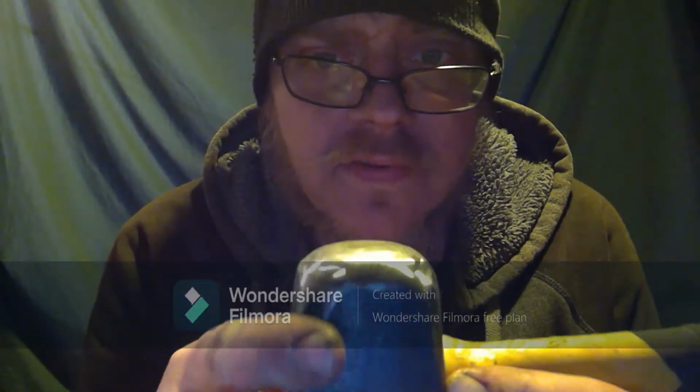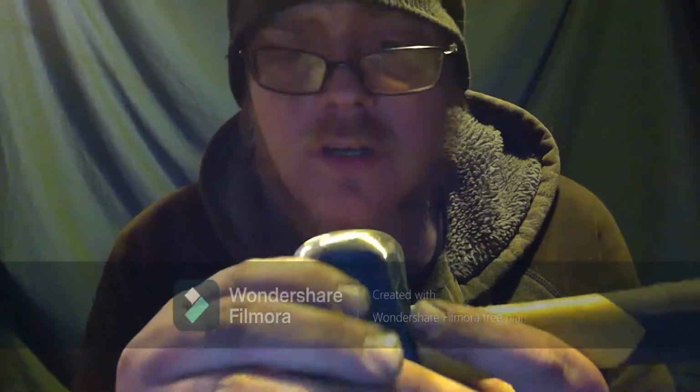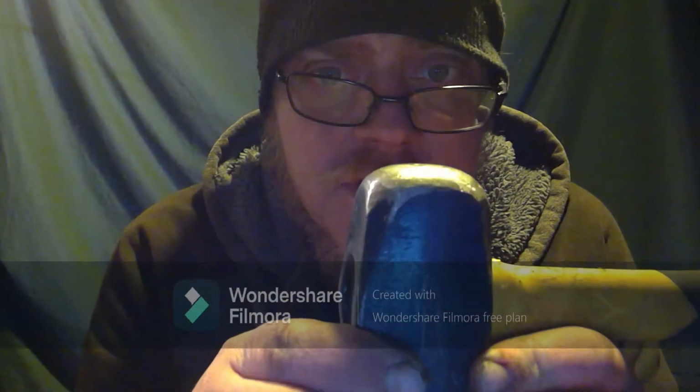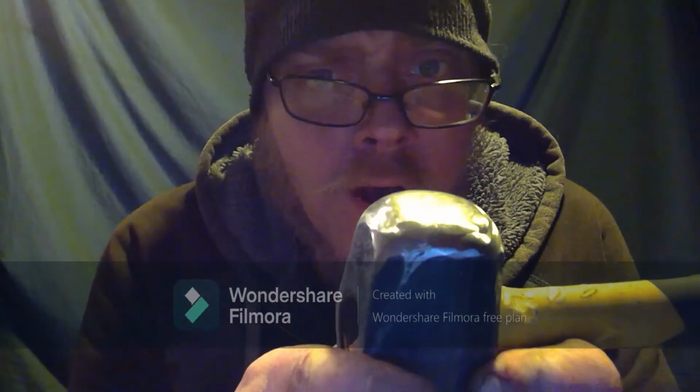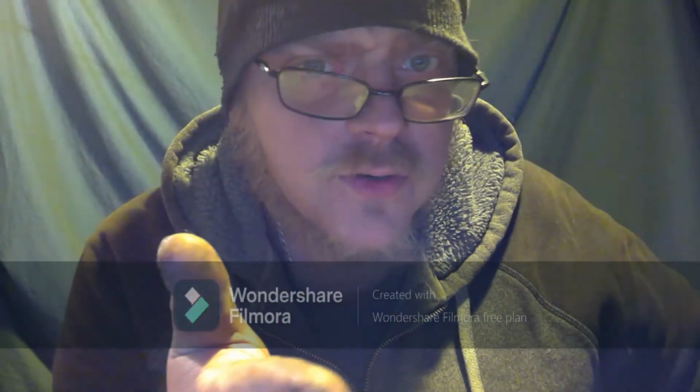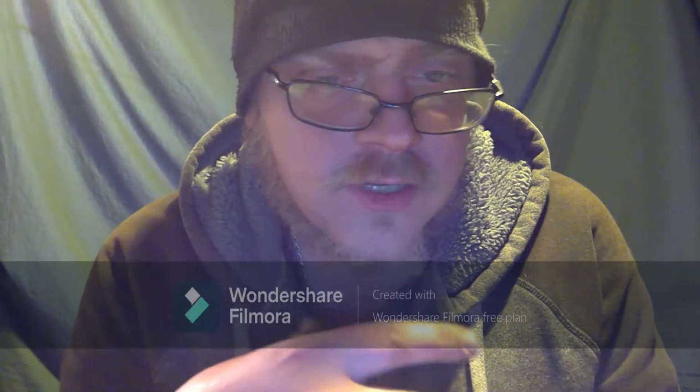Just as a final bit, we did get the face of the hammer more or less rounded. I had to put it to some use already because I was running another project at the same time as filming this video. But this was the first side that I rounded off, and this is the second, so it's still kind of flat, but you can tell that I've put some radii on it. So the only difference between this and how far you could go is how much time you put on the belt grinder, and yes, you can make that work with an angle grinder. It just takes a lot more care. An angle grinder will remove more material quickly, so you just need to be cautious about it.